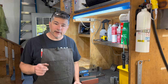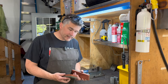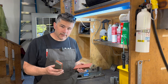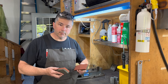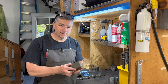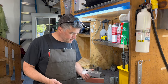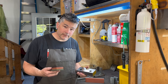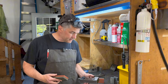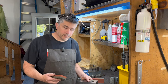All right, well, that's going to wrap up this video on how to make flat stones for your home shop. Again, the Norton stone was a dramatic upgrade over the Harbor Freight stone, which was adequate, but very, very soft. These had a little bit more rigidity to them, a little harder, and I think the result that came out was great. And then, based on the performance we saw on this piece here, I think it was doing exactly what it's supposed to do: take down the high spots without damaging the flat part of the surface. And then, as we saw, if there was a nick in the material, the stone would take it out.